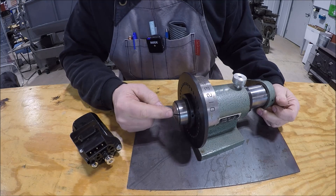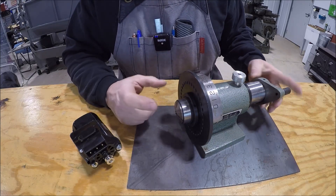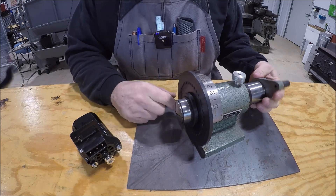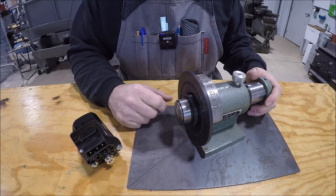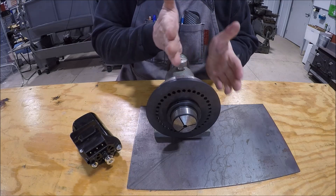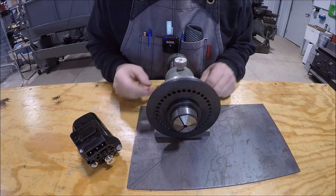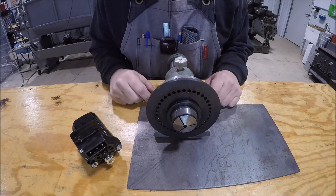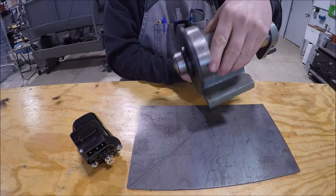I want to put a collet in it, check it, and see if it has a lot of runout or hopefully very minimal. The only problem is I don't have any high quality collets, so putting in some chinesium collets I may be introducing more error. I don't know - we're just going to have to see. By process of elimination I can keep putting in different size collets and try to narrow it down. Looking at it you can see the base is off, so we may need to do a little milling or shaping to get this base cleaned up and get a good reference surface.